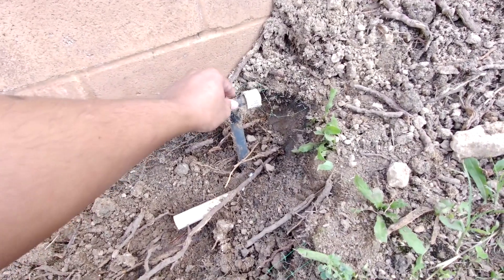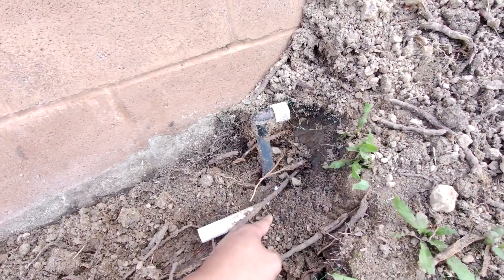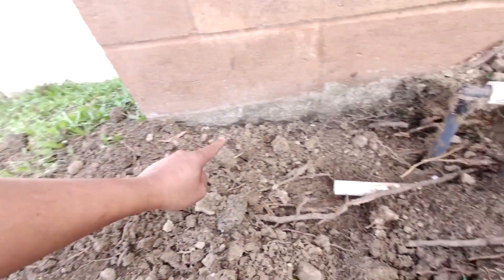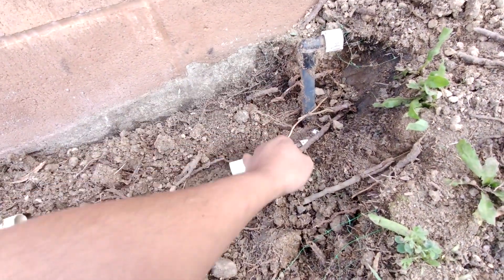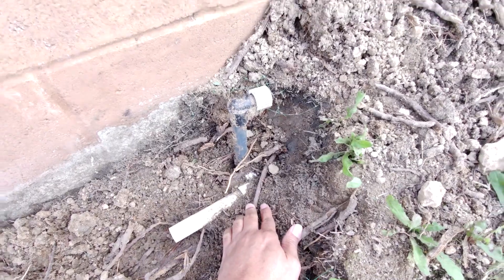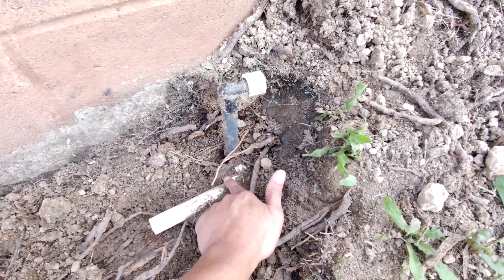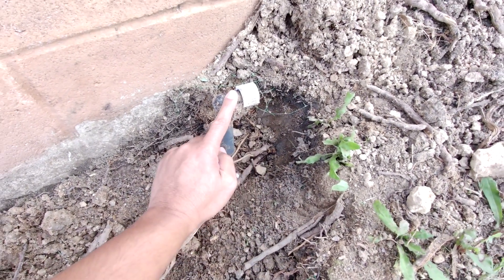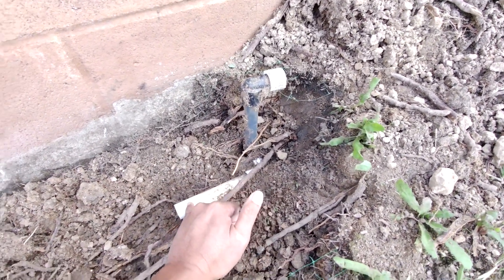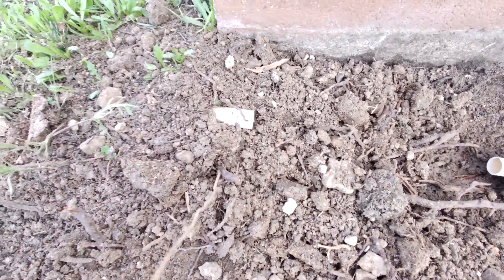What I did is I went to the last sprinkler that I'm going to need — it's basically this one right here — and I know that the pipe is going this way. So I just dug right here to find the last pipe. If you look at the sprinkler system it has a T-joint: one goes to the sprinkler that I want to keep, and then this part here is connected right over here. So what I did is I cut that off.